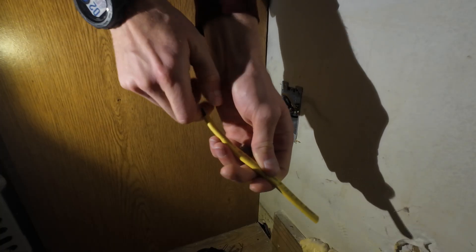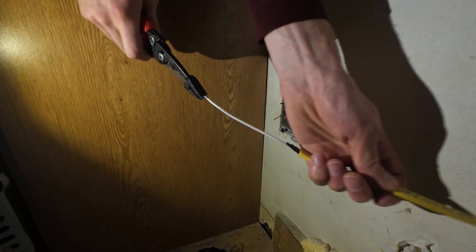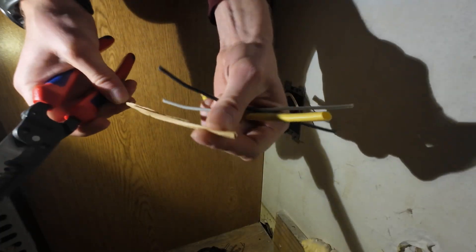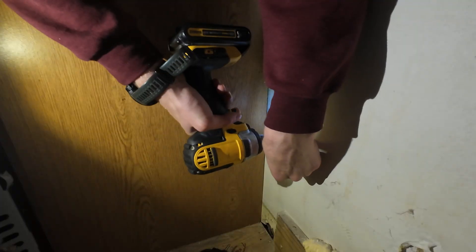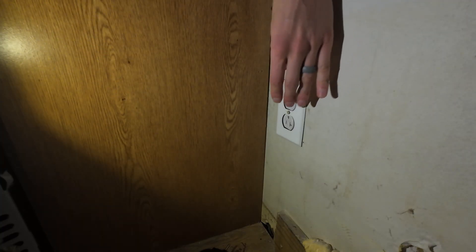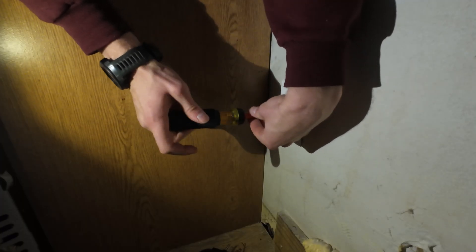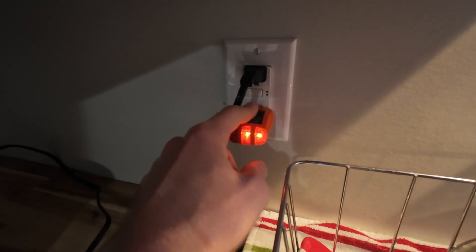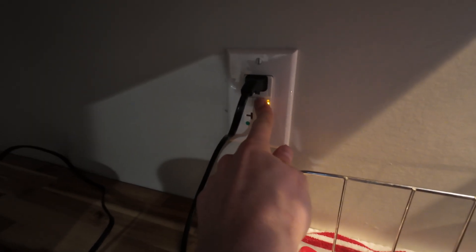I've cut myself about a 6- to 7-inch piece of NMB cable, and we're going to use what I call the jumper method, where we remove the conductors from the device and wire-nut everything in the box, then just have a small jumper attached to the device. Just powered it back on — and look at that, we're looking good. It was just a crap ground connection. Now over at the GFCI we've got two lights. I should be able to trip it — just like that. Resets good.